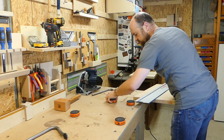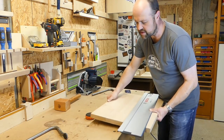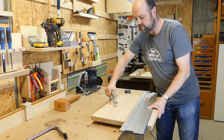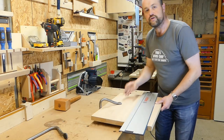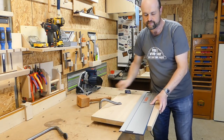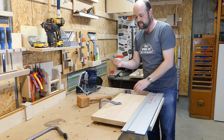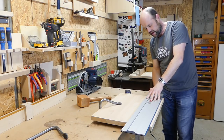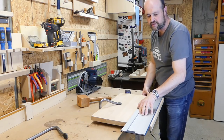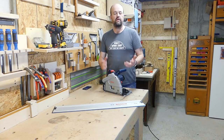If I do have to use the clamps, I put the workpiece a bit more to the front — not ideal sometimes, but it usually works. You really do need a hold-fast in that case because otherwise the workpiece would tilt over. Then I can place the track clamps that come with the track into the track and attach it to the workpiece so it really doesn't move.